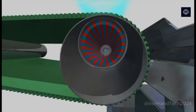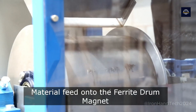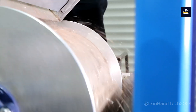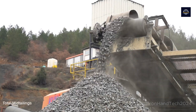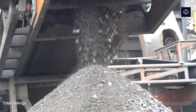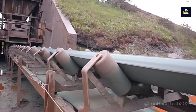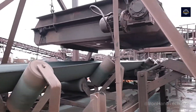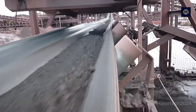The principle behind magnetic separation lies in the fact that iron is a ferromagnetic material, meaning it can be magnetized. By using strong magnets, recycling facilities can attract and separate iron pieces from the rest of the scrap. This method not only helps recover valuable iron, but also prevents contamination of other metals in the recycling process. The magnetic wonders of iron separation from scrap metal have revolutionized the industry, providing a quick and efficient way to extract this valuable material, ensuring its reuse and reducing dependence on new resource extraction.